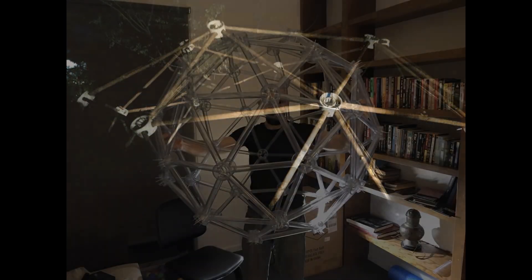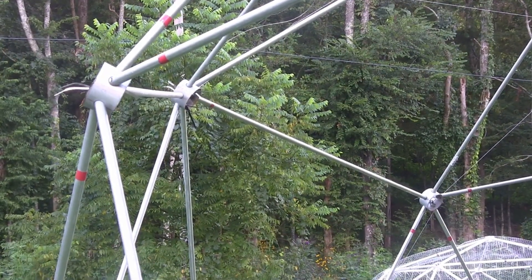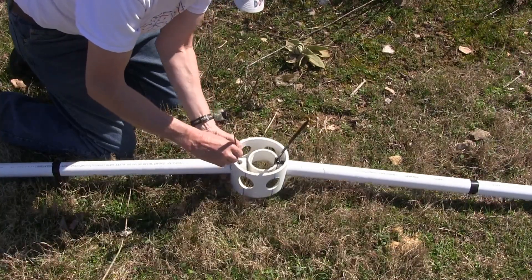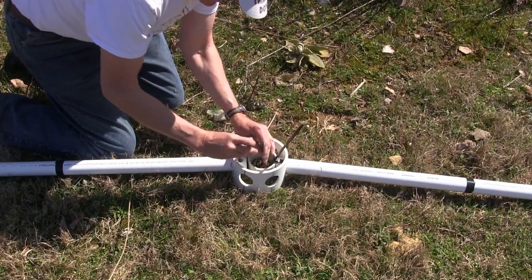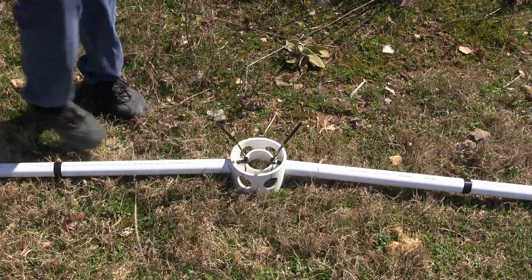This design can also make a dome or geodesic sphere with the struts, hubs, and everything made entirely out of clear PVC pipe. For heavy-duty applications, the hub connector can be manufactured entirely out of metal. But when the hubs and struts are built with plastic parts and plastic zip ties, this will produce one of the few geodesic domes that can be built entirely out of plastic with no metallic parts.